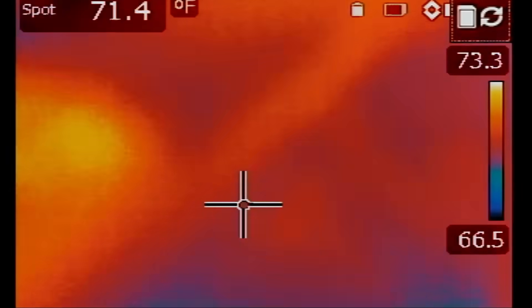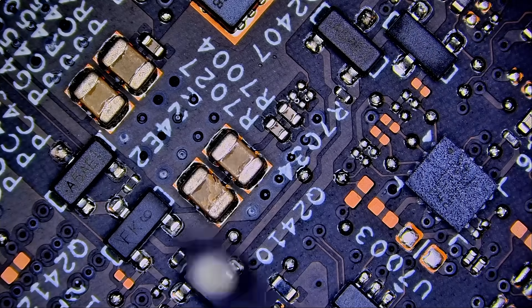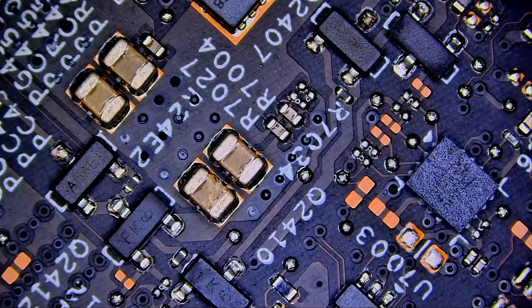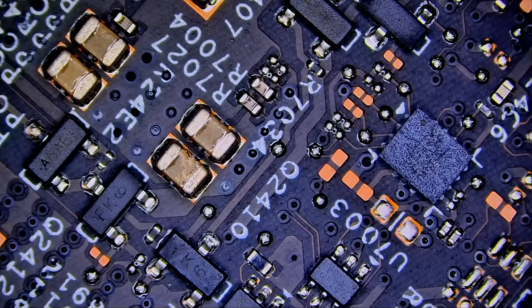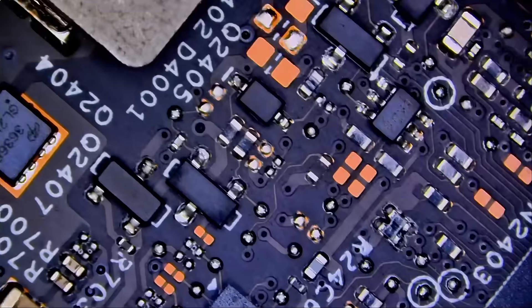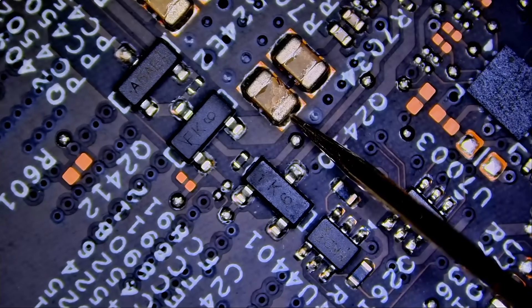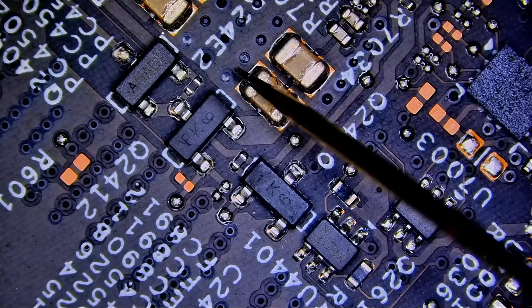So what's here? Possibly a faulty cap — I'm almost 99% sure it's a faulty cap. This one here looks off, looks discolored, looks like it's possibly cracked. This capacitor has suffered a lot of heat, and that's why you see the discoloration — or the scars. The scars of war.